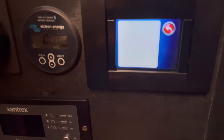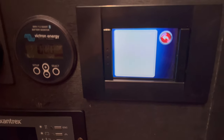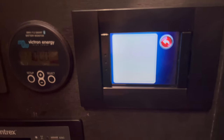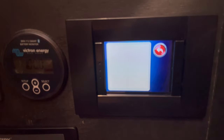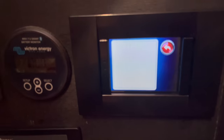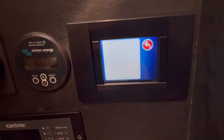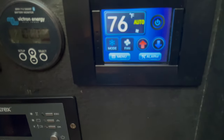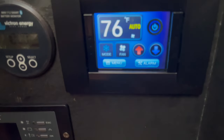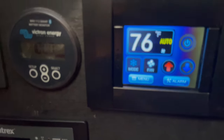The common alarms are AIR 8 and AIR 10. AIR 8 is a high pressure alarm. AIR 10 is a condensing coil over-temp cooling water protection alarm. Both of those alarms signify that we don't have enough water flow. In cooling mode it would be AIR 8; in heating mode or with insufficient flow you'd see AIR 10 — they're just opposite ends of the spectrum.